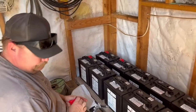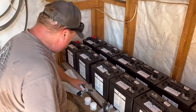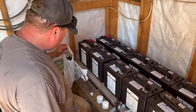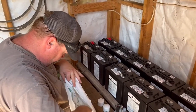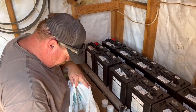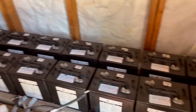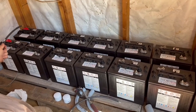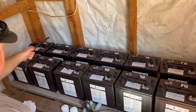Those are the positive caps. What we're doing is hooking these batteries up — at this point we're going to hook them together in series and parallel. We're not hooking anything up to our solar panels just yet because we don't have the wire run between here and the panels. We have two rows of 6-volt batteries; each row has eight batteries. The way we're going to hook these up is each row will make 48 volts and then we'll hook the two rows together.